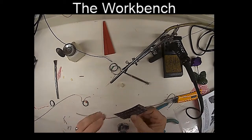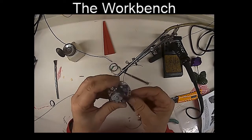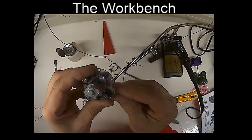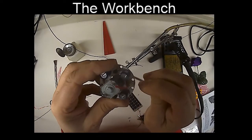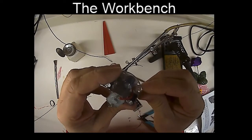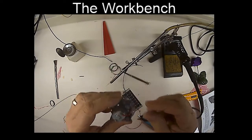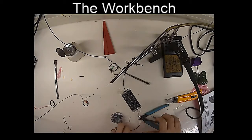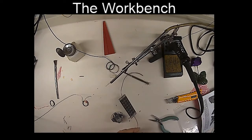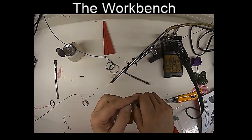There we have the positive and the negative on here, and now if you look over here on the one side of the circuit board, right in there, you'll see the solar connections, positive and negative. Now, I think in hindsight, it would have made those probably further apart if I had a choice. But, well, that's how they are, and it's not that difficult to work with. So I'll strip a little off the positive side, and strip a little insulation off the negative side, like this.